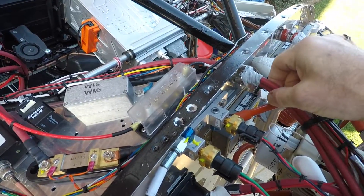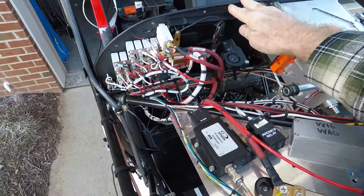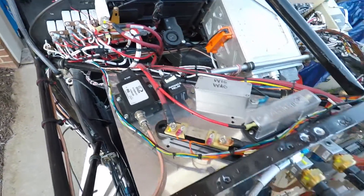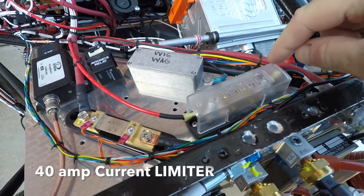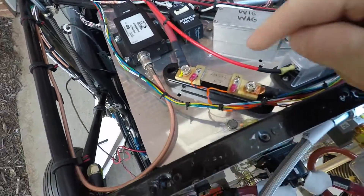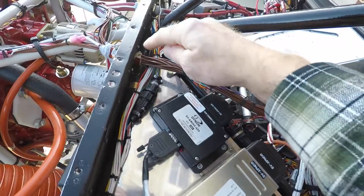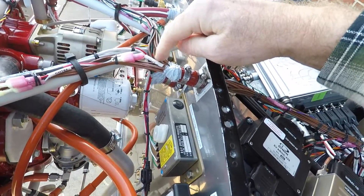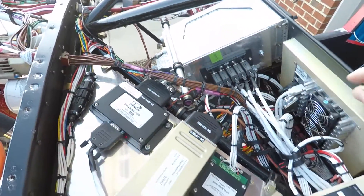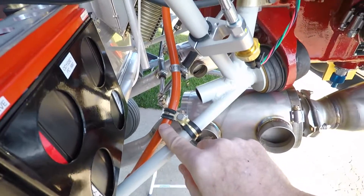As we come through the firewall with the battery lead and the alternator lead, those come through here and work their way up. I've got them in somewhat of a coil so that when the panel tilts forward it gives a little bit of slack, and then those simply come up to the back of the circuit breaker panel. Here is my 40-amp current sensor, and next to it is my alternator shunt, which goes up to the circuit breaker as well. On the other side we see where the EGT and CHT sensor wires come through, then the other wires come underneath and up, and they all flow along eventually making their way over to the engine monitor and then up to the P1 plug.